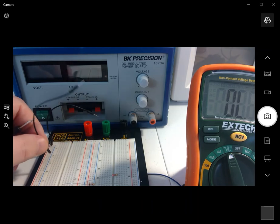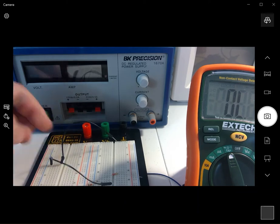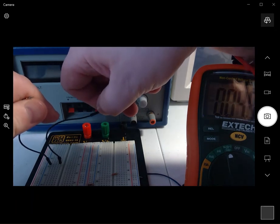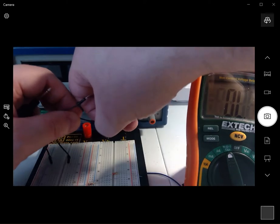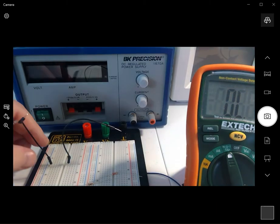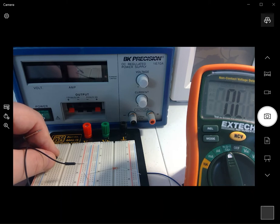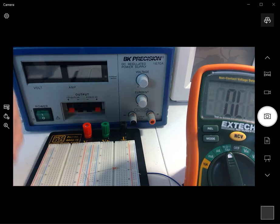These rows are connected, but there's a gap in the middle we have to be careful about. If I put two wires in the same row on the left side of that gap, they're connected. But if I move one wire to the other side of the gap, they're no longer connected. This gap is specifically for chips in a DIP — dual inline package — so one side of the leads fits here and the other side fits across the gap, and then you can connect things up to the chip.